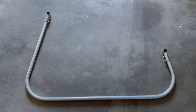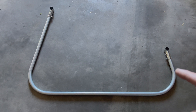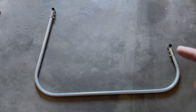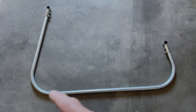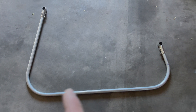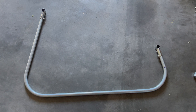I'll show you how I did that. I bent this as far as I could without causing any dent or damage with my bender. I didn't want a true full 90 degrees because by doing this, my panels fit on here at a shorter distance and I have more footing down here. If I did a true 90, I would have lost some footing on the ends. I obviously want this to be well-balanced and stay in place when it's outside.